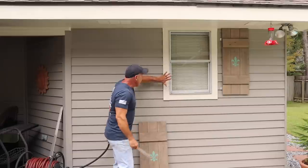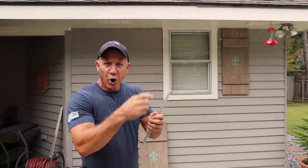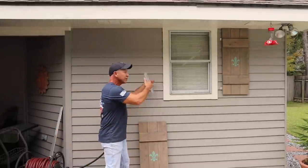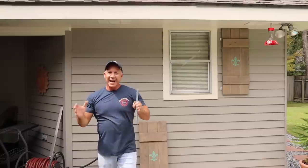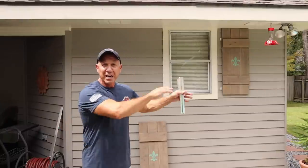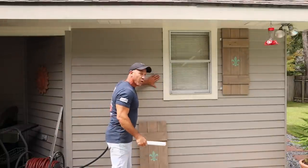Now that rant's over — one day I might address this because I'm thinking about putting vinyl siding on my house. If you are putting vinyl siding on and you want to put shutters on top of that, make sure that you pre-drill your hole through the vinyl siding so the siding can still move, then put your screws in place. These shutters here are going on wood siding; the other ones are going on brick. But this procedure will work on stucco and all of them.